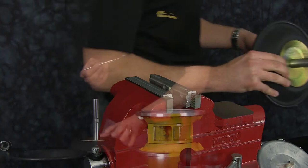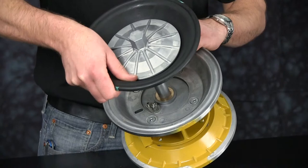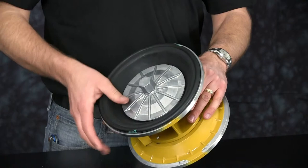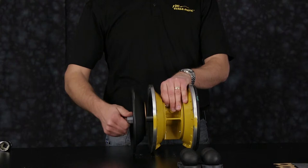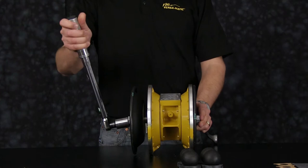Apply a light grease to the main shaft to ensure we don't damage the main shaft o-ring upon reassembly. Now install our opposite diaphragm assembly again with natural bulge in. Make sure the inner and outer plate radiuses are facing towards the diaphragm. Now we're ready to torque our diaphragm assemblies to the main shaft by holding one side and torquing the opposite side. Be sure to torque the diaphragm assemblies to the recommended torque specification listed in the service manual.